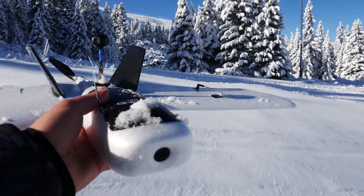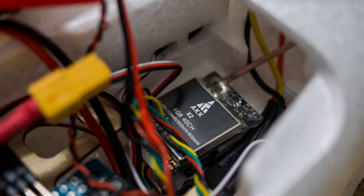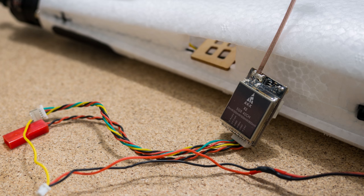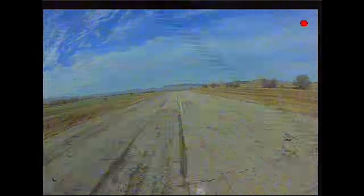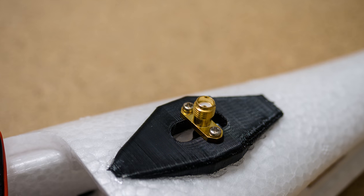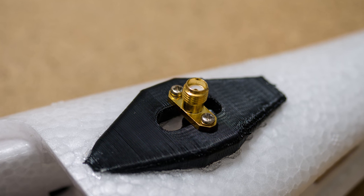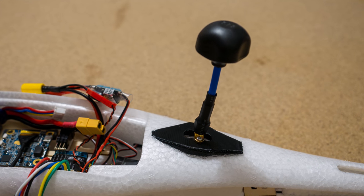I did install the RunCam Split into this one, and that is why you're enjoying footage from this plane in such high quality. For this build, I also went with one of the new AKK video transmitters that is able to output up to 800 milliwatts, though I programmed it to 200 for the dart, as I doubt I'll be going out too far. The next few times I flew the plane, I was going out 200 or 300 meters, and the video signal was perfect, but the antenna is not to be underestimated either. I had a turbo wing antenna lying around, and it was small enough to go with it. Since the AKK VTX had mounting holes on the antenna connector, I printed out a base and glued it on the dart, then screwed the connector on it, and got a pretty solid mount for the antenna.